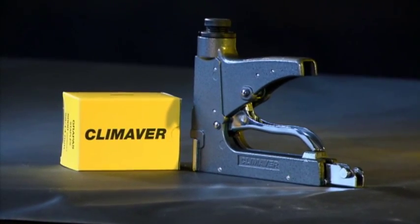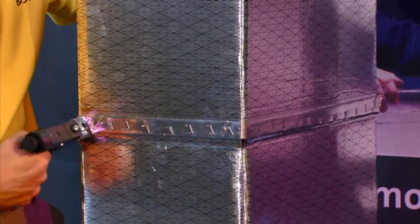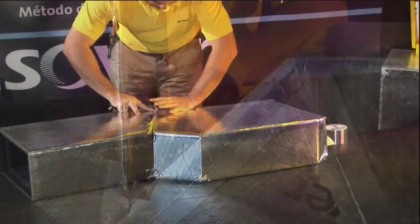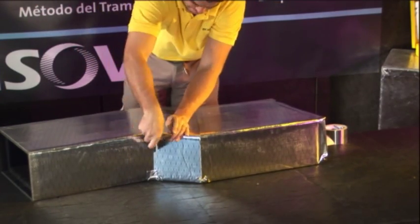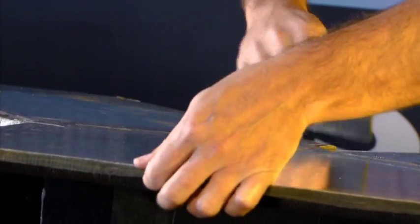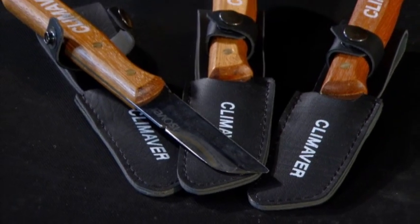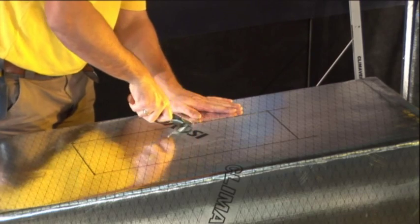The KlimaVair stapler is used to primarily fix the aluminium foil overlaps before taping. The KlimaVair spatula is a flexible plastic spatula used to remove air bubbles from the adhesion of the KlimaVair tape to the duct board surface. The spatula is firmly drawn across the tape in the same direction to create the best possible adhesion; this is achieved when the lining reinforcement is seen through the tape. The double-edged KlimaVair knife has two different applications: the sharp edge is used to cut through the board, and the blunt edge is used to remove any remnants of glass wool from newly created foil overlaps.